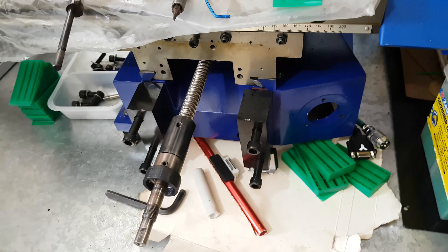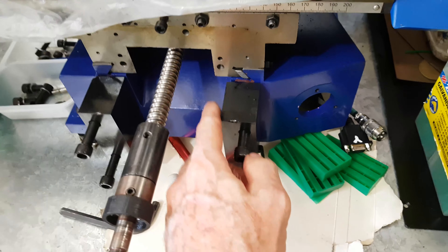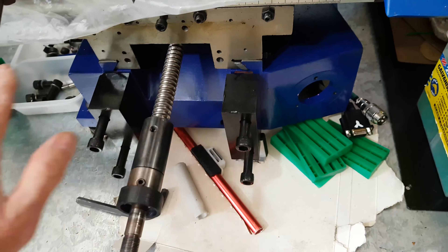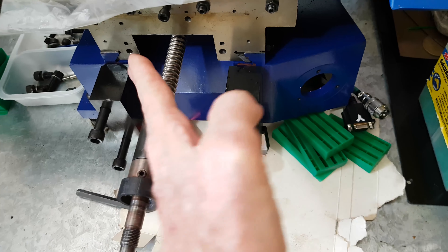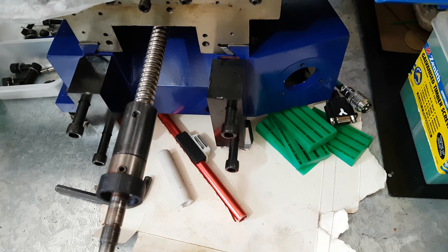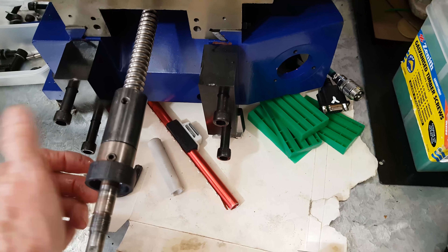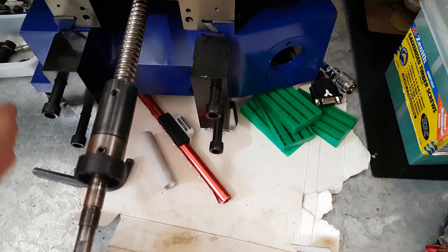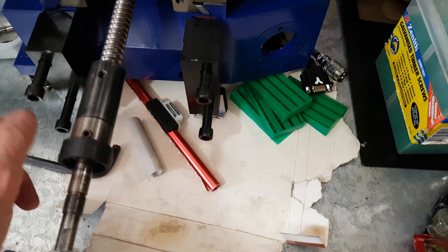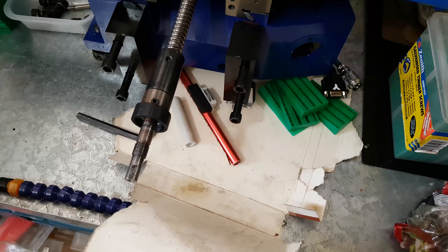That's why I got the v-blocks — you can just drop them in straight away, plus you don't have to clock them up. With the v-block it's sitting there and that surface is horizontal. It may sit this way or that way, just as long as your cutter can go from there to there, it will grind. Quick turn around, do one side, undo the magnet, swing around, do the other side, and flip it over — four grinds and it should be done.